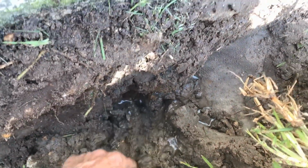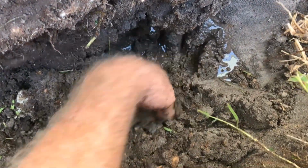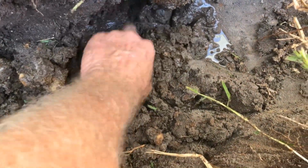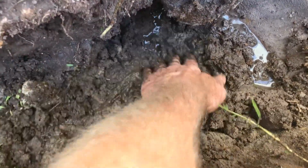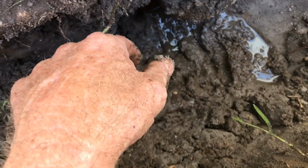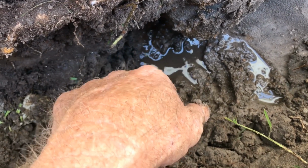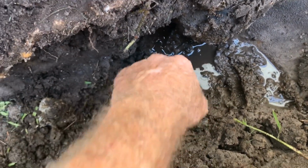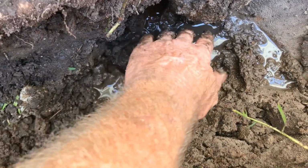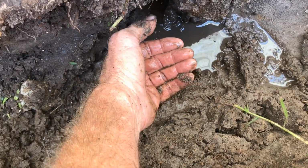So when you're digging and you happen to find a section, if you can see this, water, okay? See how that water is coming from under the foundation. Now this is a good sign, but of course it's definitely not good. It's a good sign for your footer ties. See that water coming through? Tons of water has built up under the slab of this home. Our gravel perforated pipe is going to collect that water and send it out with gravity discharge.